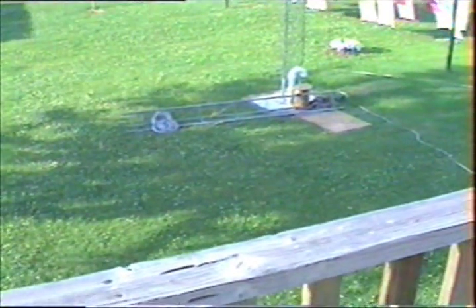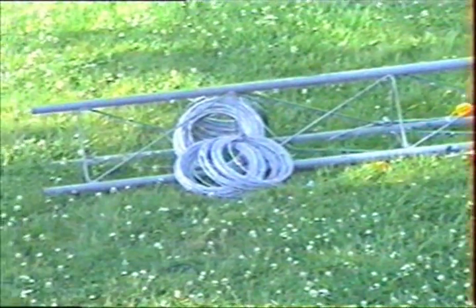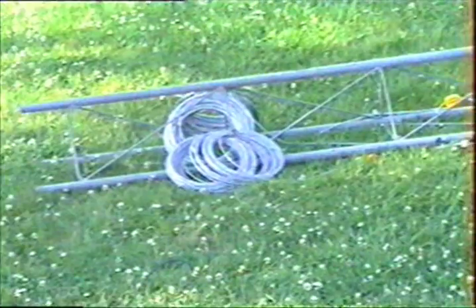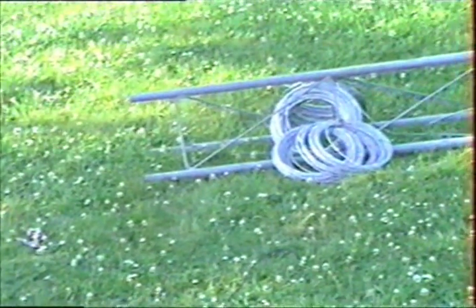On the 50-foot structure that's going up, I've already connected guy wires that are connected to the tower. I did that so I wouldn't have to be up there jockeying around doing that while I'm 20 feet above my first set of guy lines. There's enough guy line there to go probably a couple times, but I didn't want to cut it and waste some, so I've got those tied in loops. They'll ride the tower section up, I'll bolt it down and then drop the guy lines and secure them.